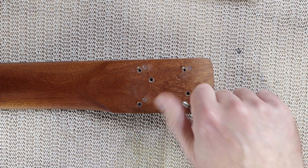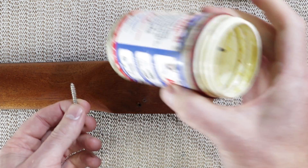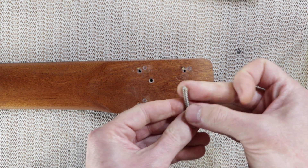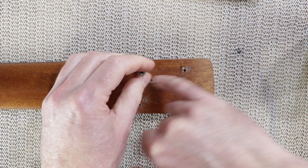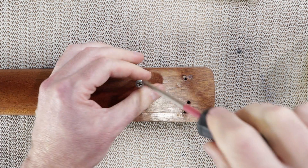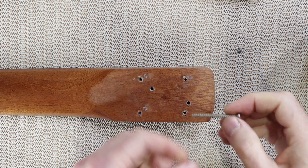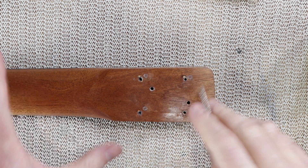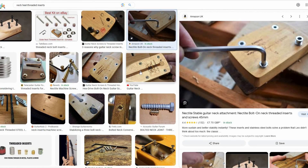The other thing I do with that in mind is lubricate these threads ever so slightly with a tiny amount of lanolin grease - literally a tiny dab - and I'll just work that into the lower threads. When I install the screw it's going to smear a little grease into those threads. It doesn't hurt to put it in partially by hand first to get the grease in there. By lubricating the threads it's even less likely to cut a new thread, and it's almost always going to follow the old thread so you won't have the issue of chewing them out.